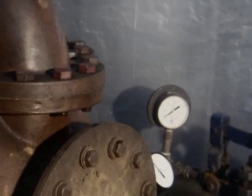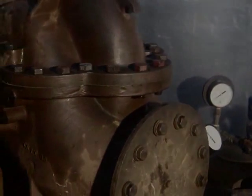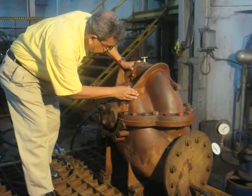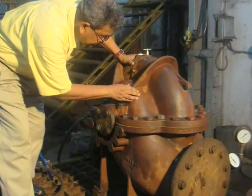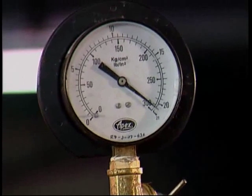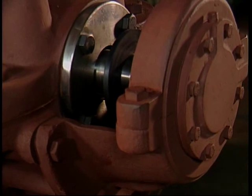Hydrostatic pressure test is done on the pump casing at 1.5 times the maximum pressure. We consider this test satisfactory when no seepage or leakage is observed. We have to look carefully at areas subjected to maximum hydrostatic force and also vulnerable areas of casting where there is a change of section. A failure of a hydro test due to leakage from places other than bolted or threaded joints is considered a major failure, and we need the buyer's written approval before any rectification.